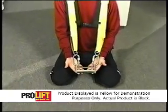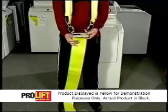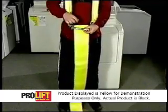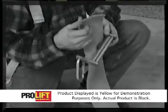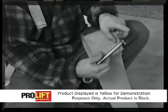At this point, the two lifters should be wearing the harnesses with the attached metal triangle rings, the locking carabiners, and the 5-inch specialty tension buckle. The next step is to thread the 5-inch webbing through the specialty tension buckle. Make sure the webbing is flat, not twisted. Take the end of the webbing through the back of the tension bar, then over and down through the specialty tension bars.